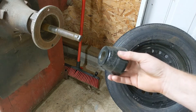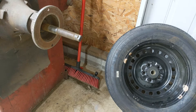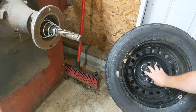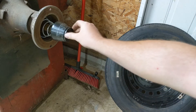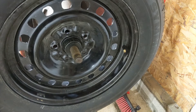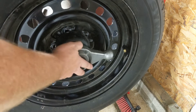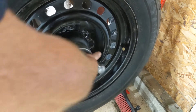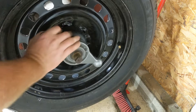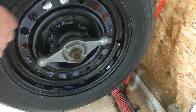Right off the bat you need to find a cone that doesn't go through the center of the tire — this one here will be adequate. You also need to find a spring. Put the spring on the shaft first, then take your cone and put it on like that. Set the tire on and then tighten it up. Once the tire is on, take the locking device, stick it on, and tighten it as tight as you can get it. Now it's nice and tight.